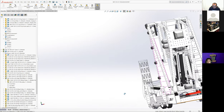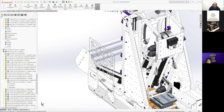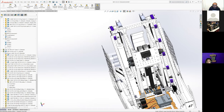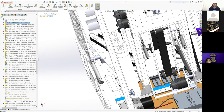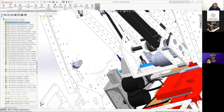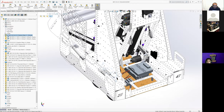So it led to these square tube frames that run on either side of our ball tower, that come back at the top and are mounted to the top climber cross support, and at the bottom they have this one by one that crosses the whole chassis. This originally was spaced between the drive rails, but we ended up moving it up to accommodate the climber gearbox, which we'll get to later. And that worked well enough.